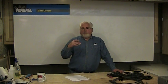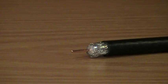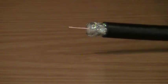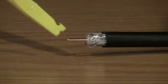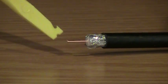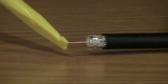Let's take a quick look at what the construction of this wire actually looks like, and then I'll get into the installation tips. Here is a close-up of the actual RG-6 cable. When we strip it and prep it for putting a connector on the end, we need to do that two-step strip — look that up on the channel — and we will need to expose some of this center conductor.